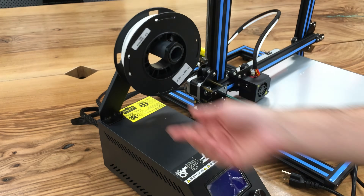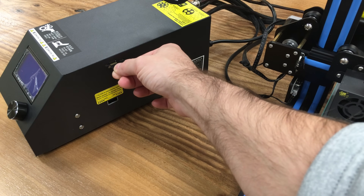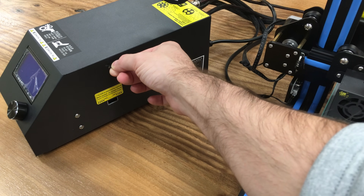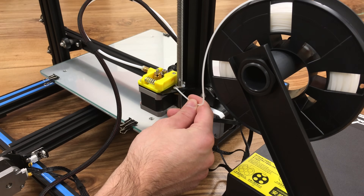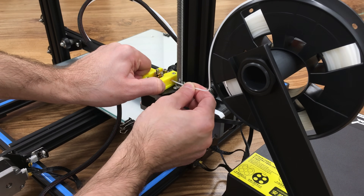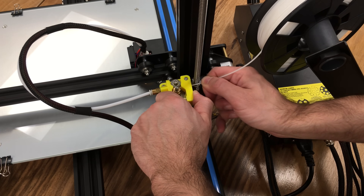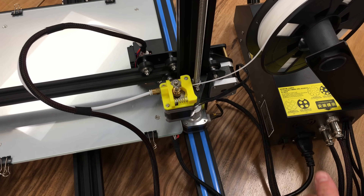Place the rod, put it in, and fasten it back, then put your filament on. At this step, arrange your cables with zip ties and make sure none of the cables are creating any obstacles or tension in the moving directions. Take your given micro SD card and install it into your device. Take the edge of your filament and move it towards the guide — there is a hole right here, push and move your filament through the hole. Keep inserting the filament until you can't insert anymore, then stop so you don't break it.